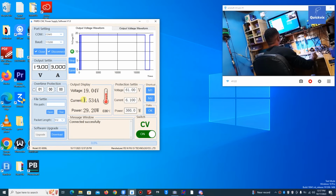So now the laptop is charging, and that's it. And pin 15, before we had 0 voltage there. Let me check it now. It stays the same. We have no voltage from the low side.